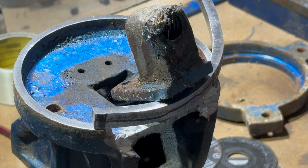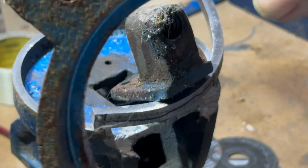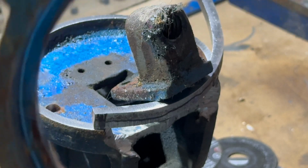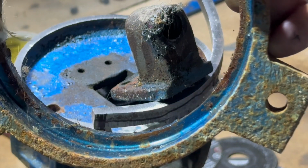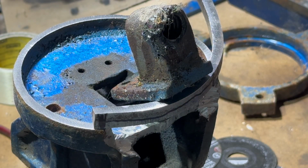And if your radius is not right when you've put it in, you can just finish it off with a sander, as it is going into the other part of the vice, the foot. You've still got probably about 6 mil all the way around, so you can have a little bit of a play in it. You're not going to get it exact, but it's all down to the welding. So we'll try and get that tacked in now, and see where we go from there.